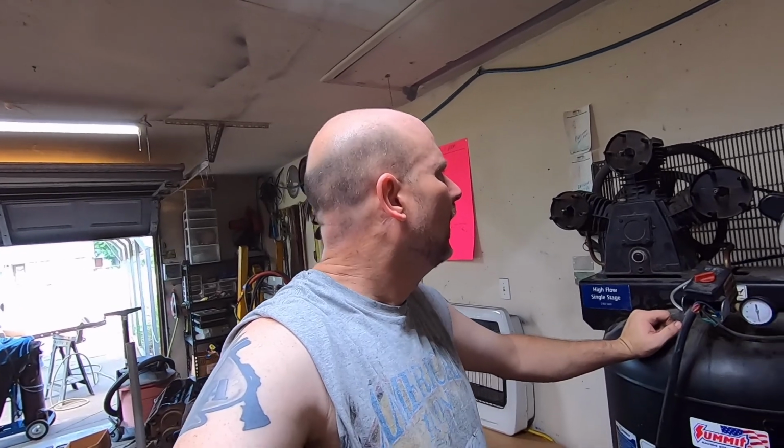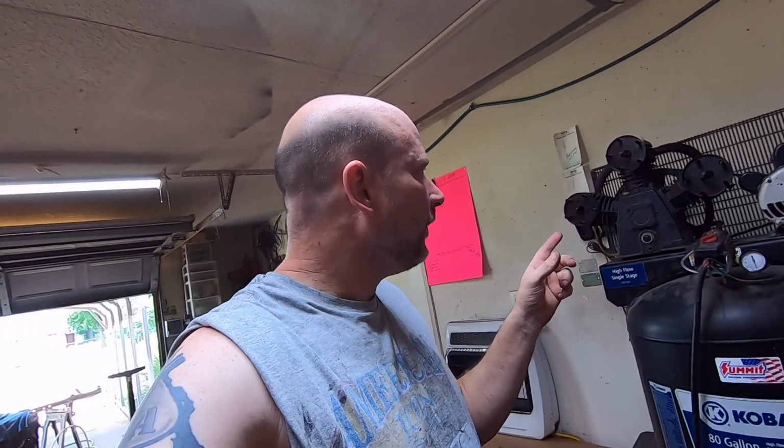But I ended up taking sandpaper to the piston, because if you saw the gouge marks on the edge where the rings go, it was pretty rough looking, so I smoothed all that up, edged it real nice. I cleaned the carbon off the top of the piston. Then I used 600 grit sandpaper on the entire piston, just cleaned it up pretty nice. And I took the rings and cleaned all those up. The top 2 rings were the same size. I calipered them out and everything. I Scotch-Brited them up a little bit, and I switched those. I put the top one in the middle and the middle one on the top.